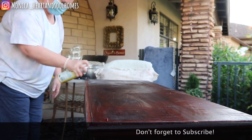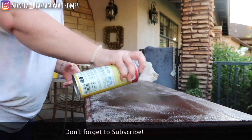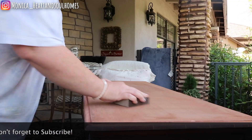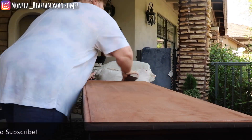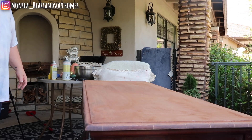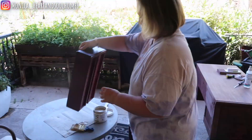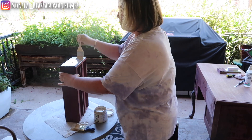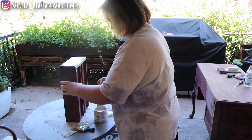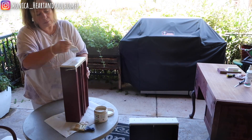As I kind of expected, this being such an old piece, the varnish and the stain — I don't know how many layers of stain were on this piece — and the different kinds of varnishes they used back then, oh my gosh, it was like it was never ending. To get into all the little nooks and crannies, I spent two days. I pulled out the sanders, I pulled out hand sanders, just to get in there and do my best to get it down.